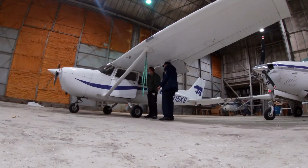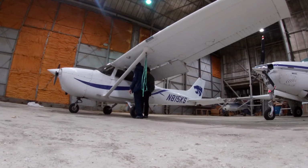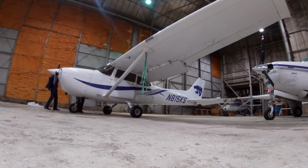So there's five drains on each wing, and there's three underneath. We just have one here. When you press, fuel comes out. Just a little bit, not that much. I'll just show you one. So like that, it's about that much. You basically do it for each side. So you've got your fuel strainer, your fuel reservoir, and your fuel selector.